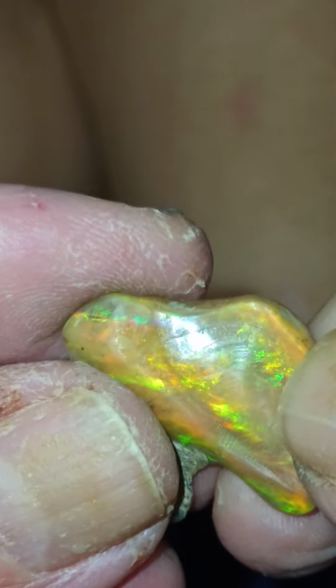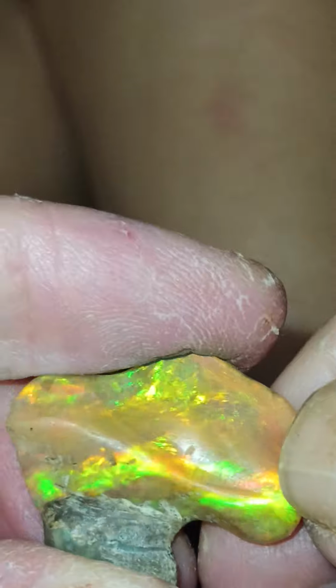And so if I'm going to put a bezel around that and set it for my lovely wife or friend or something, then I can do this. And I can lay a bezel up there and hold the stone in place. And this way you're not going to break your stone. And you can look at the edge and look at the way the light plays across the stone. And sometimes you see places that you missed or scratches that are in there that you need to get out because the light's passing across it at an angle.